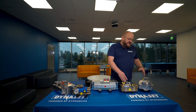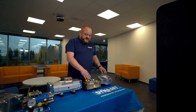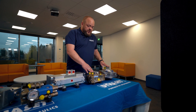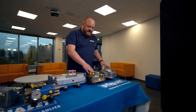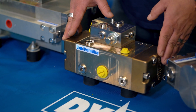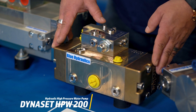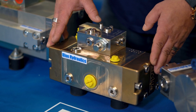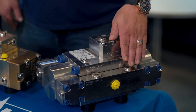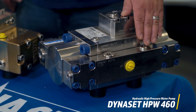These pumps are made out of better quality materials for more demanding situations — they are made for subsea use, and seawater is one of the most harsh and demanding environments for any water pump. This pump is made out of special aluminum bronze alloy, which has great mechanical and chemical resistance, and this pump is made out of stainless steel to endure seawater effects and fulfill subsea use requirements.